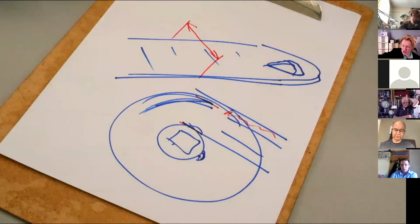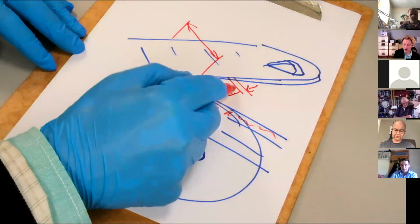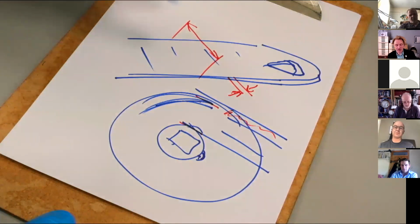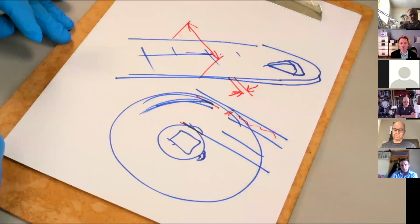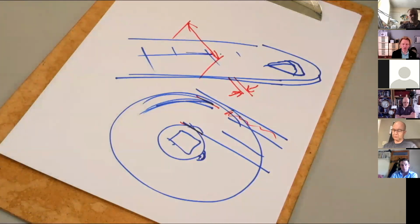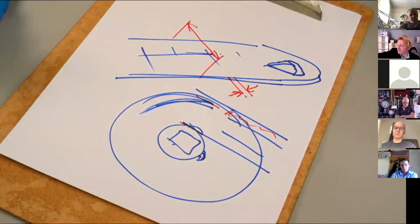The challenge is in the thickness of the spring, or what the watch people call the strength of the spring. And the reason that's difficult is because the strength of the spring is proportional to the width. Okay, so my physics isn't that amazing, but if we half this value, we have a spring that's half as high, half as wide. We've got half the strength of the spring. However, that doesn't apply to the thickness of the spring. The strength of the spring is proportional to the cube of the thickness.